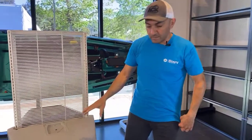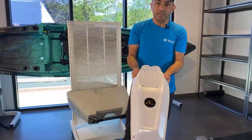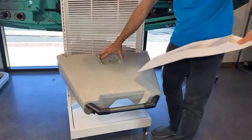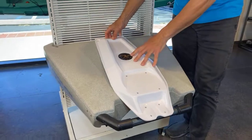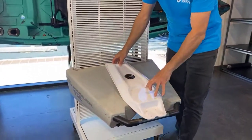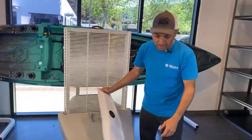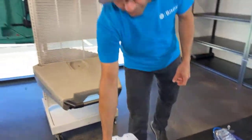For the Pro Angler, what you do need is a PowerPoll plate adapter from Hobie. What this does is it goes in the back of your Pro Angler, replaces the cover for your rudder, and sits like so. Essentially all this plate does is give you the hole pattern you need for your Micro Anchor PowerPolls. We use that same hole pattern for our PowerPoll adapters and install our motors onto that. The installation is super simple — you need almost no tools. All I have is a Phillips screwdriver and a couple of wrenches, and we will get all of this done with those three tools.